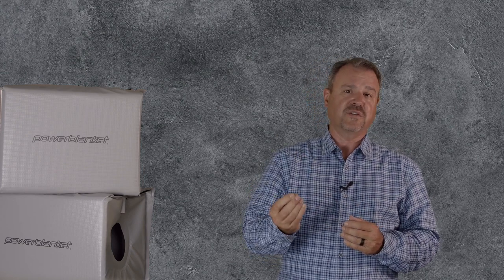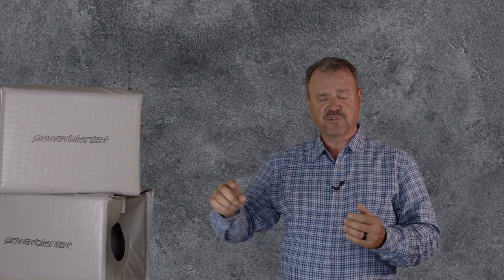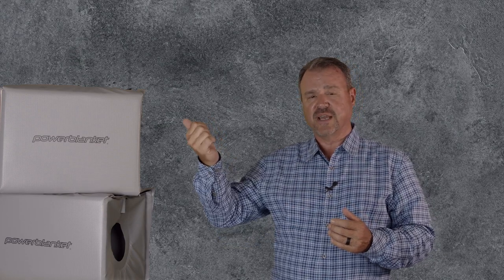A circulation heater, for example, can be used to heat a fuel gas stream going to a turbine. One of the most important things in a turbine is to not have any water in the stream. When that gas travels through our circulation heater and goes to a fuel gas heater, it can knock out all of the water. They're actually called dew point heaters.